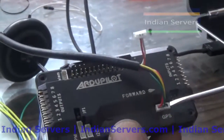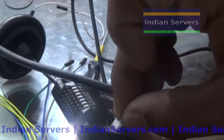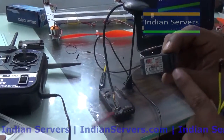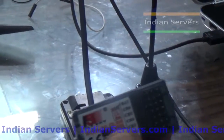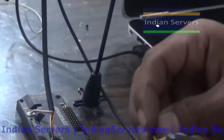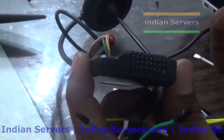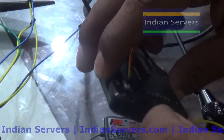If you are using an old GPS module, connect it here. Next is I2C. On the input side we will connect our receiver. The operating voltage of this receiver is 5 volts. This is the 5-volt line and this is the ground line. By using two connectors we are going to provide power supply. The last connector is ground and the other is the 5-volt line - you can connect anywhere along this line, ground to ground and 5 volts to 5 volts.